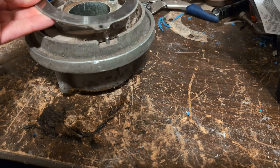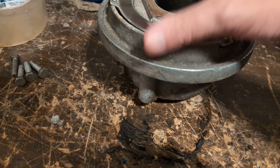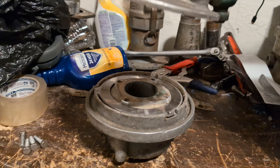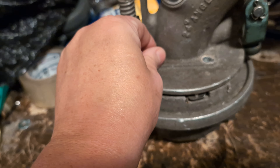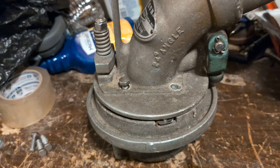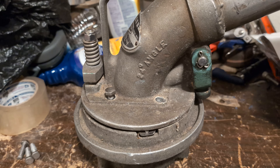This is the brake disc basically. Looking at it, it's pretty smooth. What happens is this pad that's under here — see that pad right there, kind of like a pad what you find in a car, similar to that. When you attach this to the base, you tighten this nut, the spring pushes down on this, which pushes down on the pad underneath here. It pushes on that brake disc and adds tension so the gun would actually turn slower when going forward and reverse.